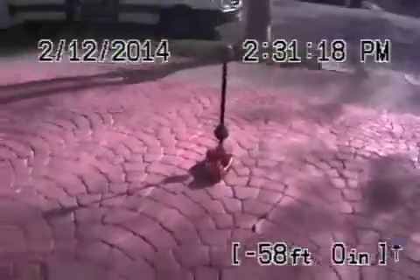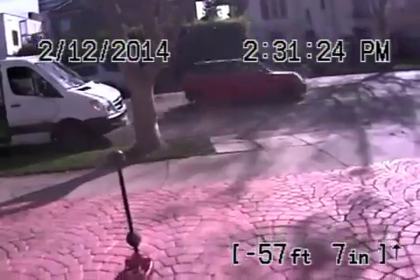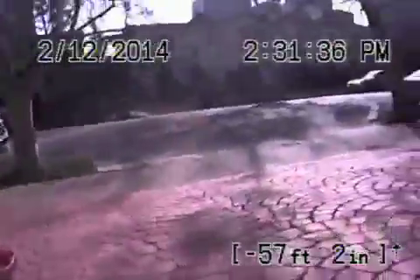There's the clean-out right there. The pipe comes across the driveway, and right there where you see my locator standing, that's where it takes the dive, and then it continues that way. At the sidewalk, it's 10 feet 2 inches deep. So we're 23 inches there, 10 feet at the sidewalk. It comes across like this and connects to this ABS clean-out right there. We're going to go ahead and stop the recording here.